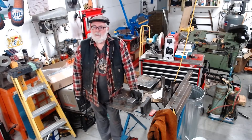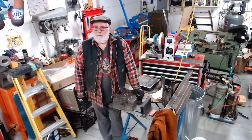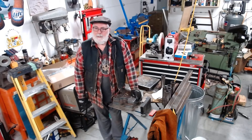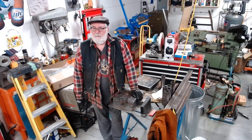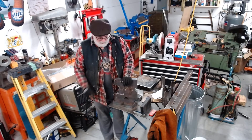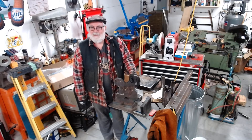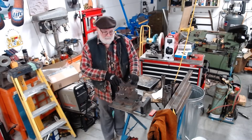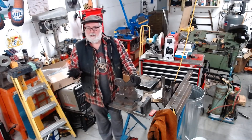I saw some pictures of plates that were a little more heavy duty and you can find them commercially, but the heavy duty part leads to expensive shipping. So I thought I know a guy that's got a high definition plasma cutting table — I bet he can help me out. I had him cut me these press plates. This is inch-and-a-half mild steel. Mild steel is as good as anything because worst case you're going to bend this, not shatter it — even with a hundred-ton press they'd bend, not shatter.